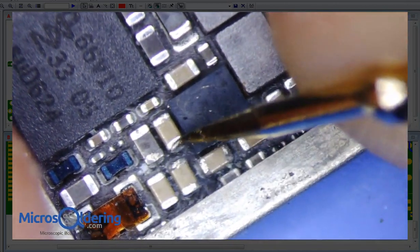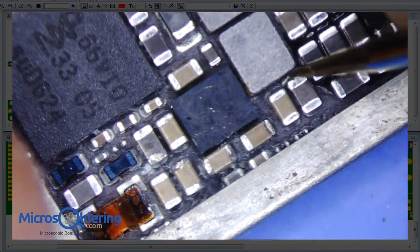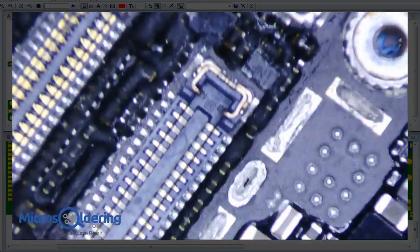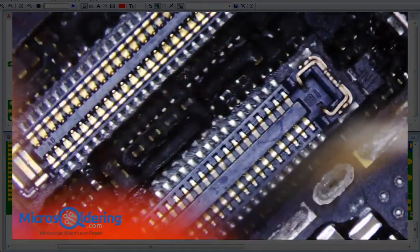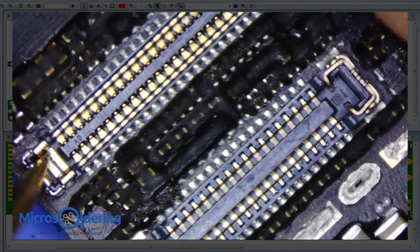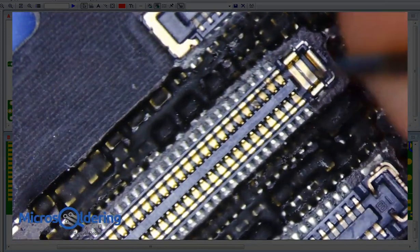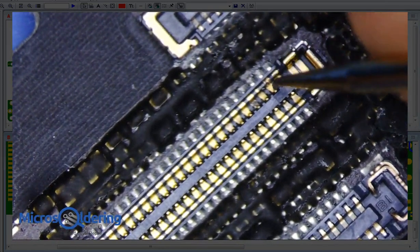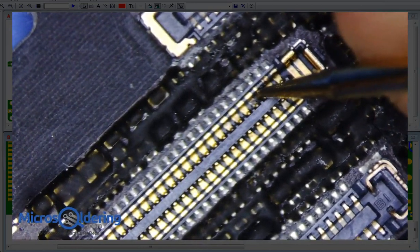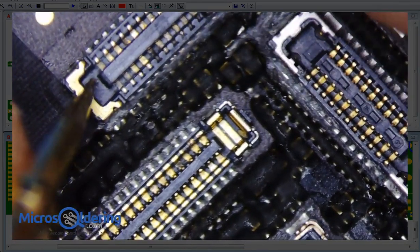My guess is that it's probably not the cap that's shorted. It's probably under here that's shorted because they can kind of see it. Okay, so we're gonna definitely remove Chestnut, and then up here, let's just kind of probe a little bit. Let's probe the backlight system a little bit. You guys can't even see it, can you? Right, so I'm basically just probing the anode line of the backlight system, and then these are the cathode lines right here.